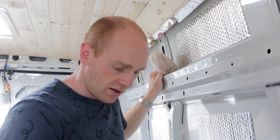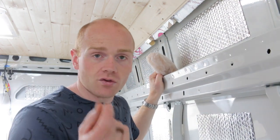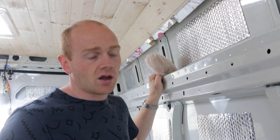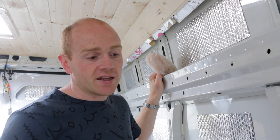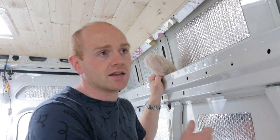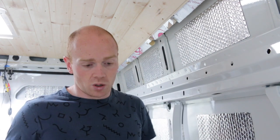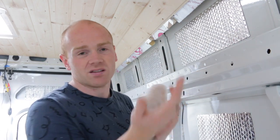In this van there's a kind of gutter down by the sill underneath that we can access from below. It's also got rubber bungs in it, so if there was ever any chance of any build-up, you could leave those open and everything would make its way out. I'm going to leave them in for now, but in six months or maybe a year I'll remove one and feed up a humidity meter to take a recording — just to see how dry it is behind there and make sure there's no humidity build-up. Providing the vapor-check barrier goes in on a sensible dry day when there's no condensation, it should remain a sealed environment behind there.